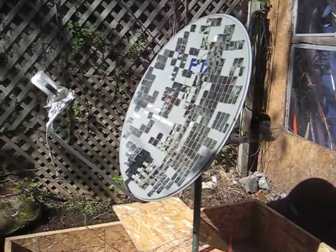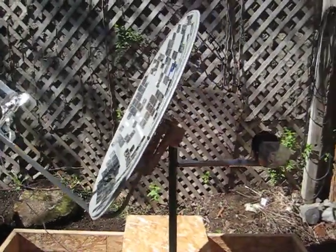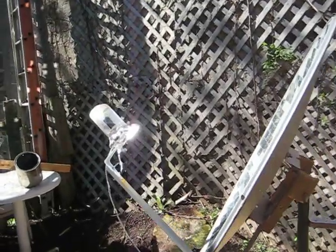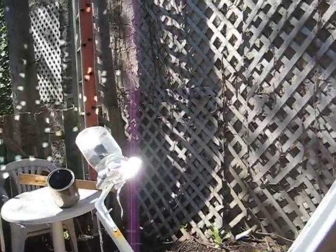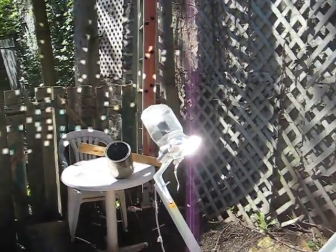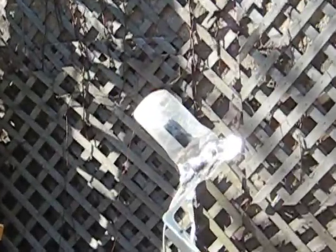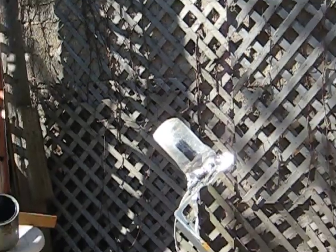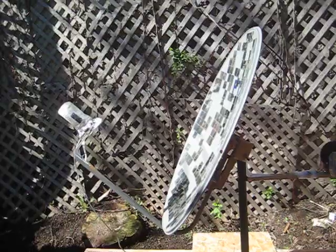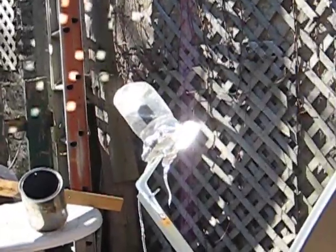You can see it's a very precise adjustment — very small — one vertical and one horizontal, to keep the concentrator perpendicular to the sun. This is the key. The two-axis tracker must be here in position; this is the only place where it can be to keep the focal point in the right place.